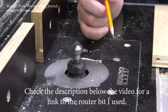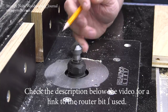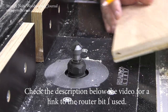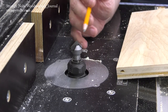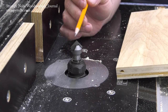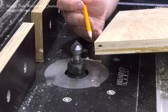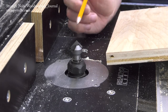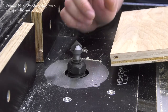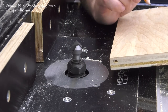I'm going to use a regular v-groove bit. These are fairly inexpensive if you get the smaller ones. This one is three-quarters of an inch wide, which is just as wide as my workpiece. The problem is that leaves almost no room for error. If I had an inch-wide one, that would still be relatively inexpensive and it would give me a little extra width compared to my workpiece, so that would be better. They make them up to an inch and a half wide — those are about $65. I'm going to try to do it with a three-quarter inch wide bit.